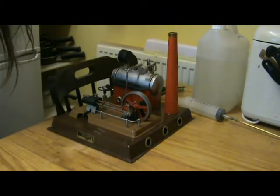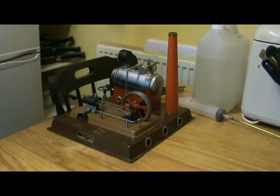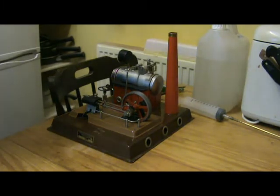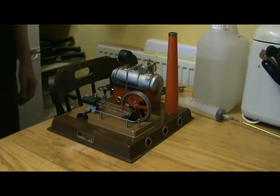I can hear ominous creaking noises as it warms up. I hope they're coming from the firebox, not from the boiler. The gauge is calibrated in bars. I don't know what the safety valve lifts at, but there's a red line at 1.5 bar. At the moment it's sitting at 0.15 bar. So there's a fair way to go yet.